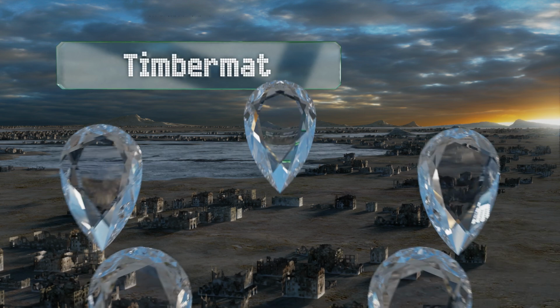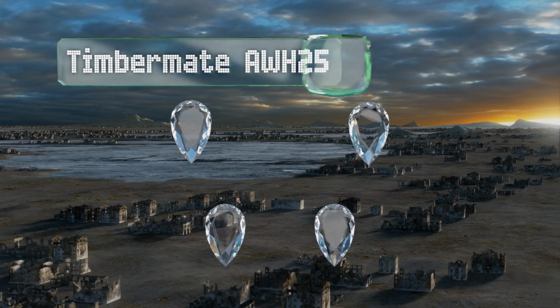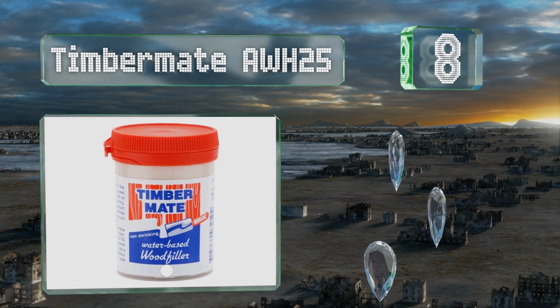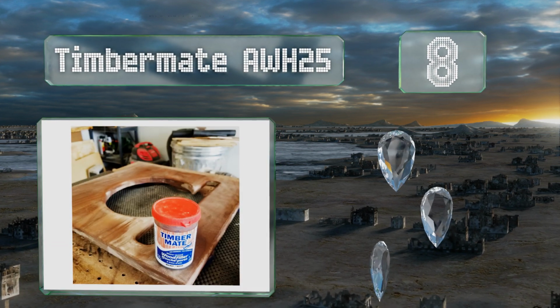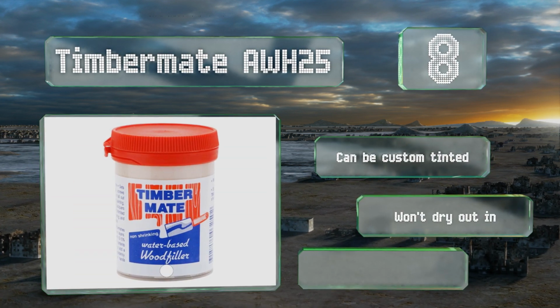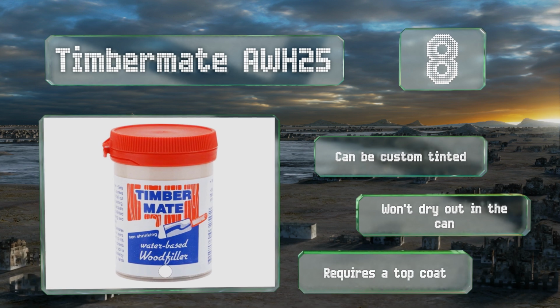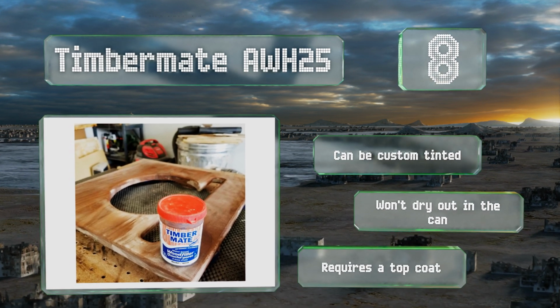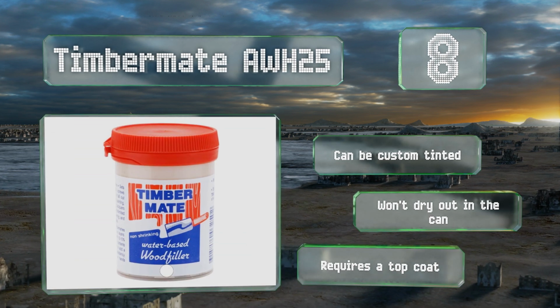Coming in at number 8 on our list. Imported directly from Australia, Timbermate AWH25 is a water-based putty that adds volume to pitted or rotten timber and leaves a sandable and paintable surface behind. Since it's water-soluble, it should only be used for indoor purposes. It can be custom tinted and won't dry out in the can. However, it requires a top coat.